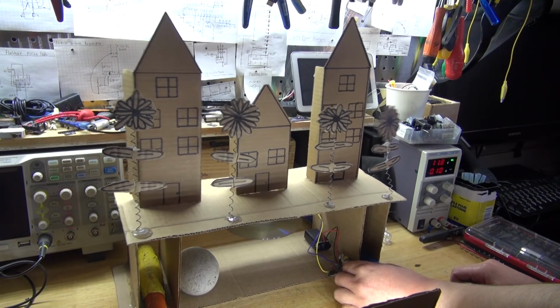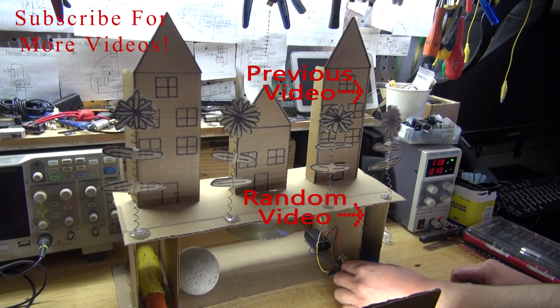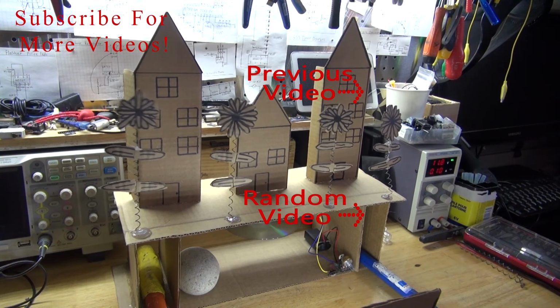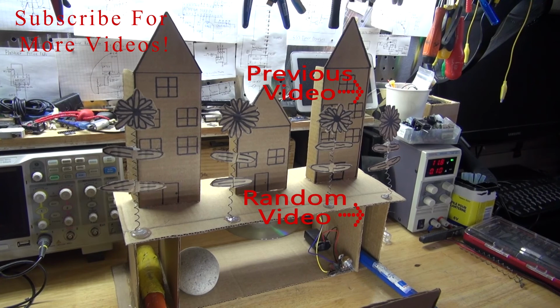Now you know how to make your very own DIY earthquake model display with using a TIP122 Darlington transistor, which will control the speed of a DC motor, which will then control the frequency of the earthquake.